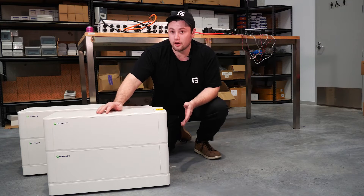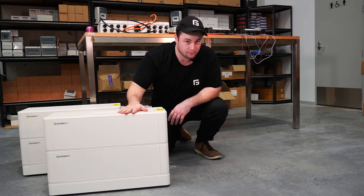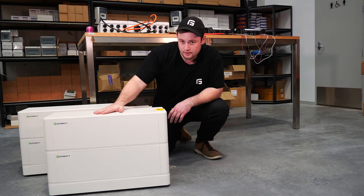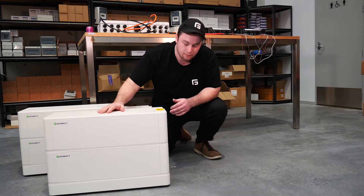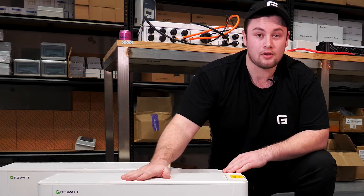With these types of inverters you can go up to six in parallel. The first thing you need to do is set up your battery stacks. We're going to demonstrate on this one here how to set that up. These stacks can be up to 10 high — today we're just using two. Each battery stack requires its own base and its own wiring.